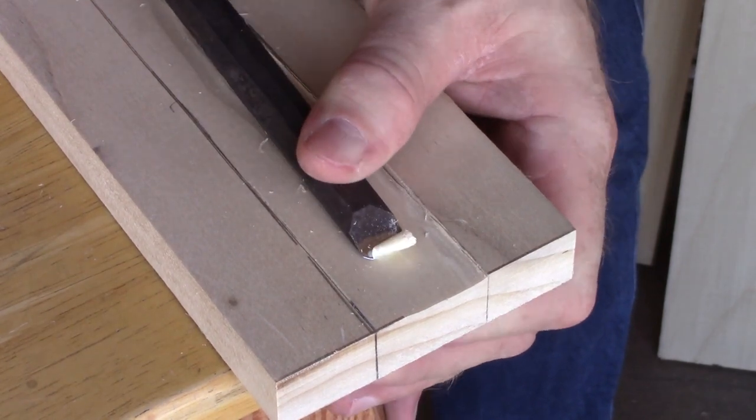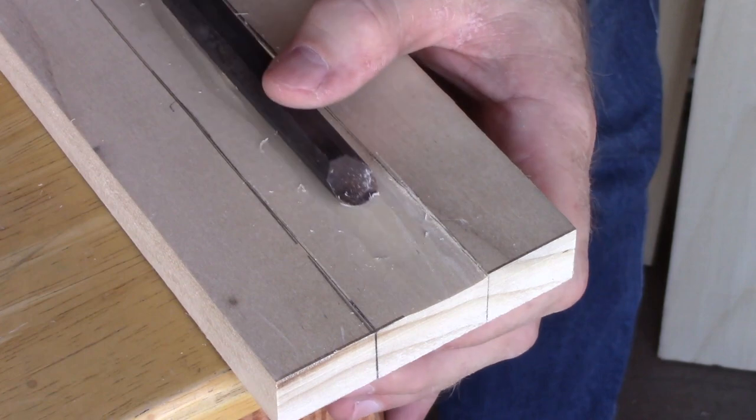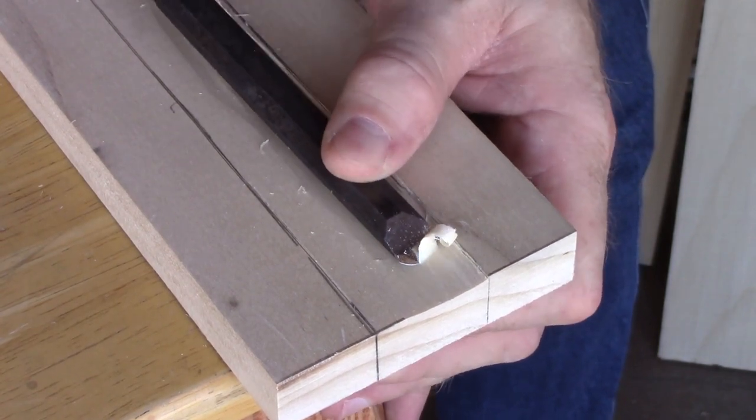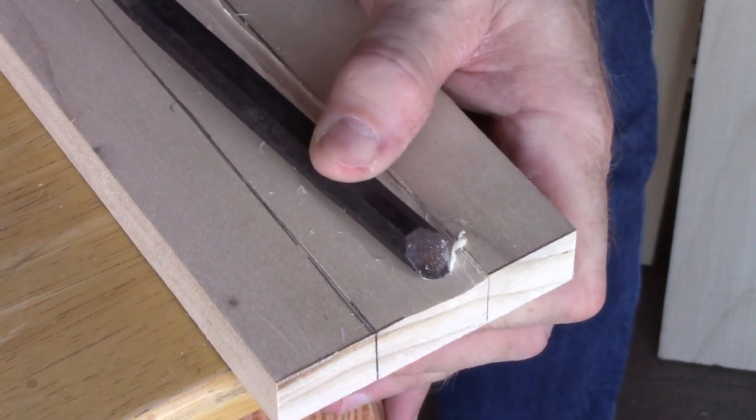The groove should be a millimeter or so deeper and wider than the blade, so the blade doesn't bind when it goes in and out of the scabbard, except in the area of the habaki. The habaki should fit with a gentle friction fit and bind in the mouth of the scabbard.